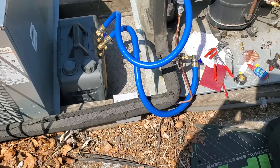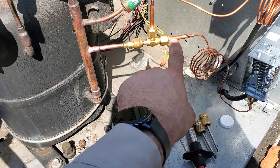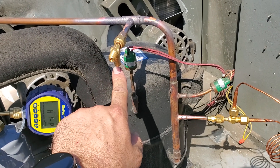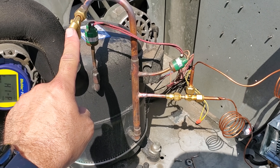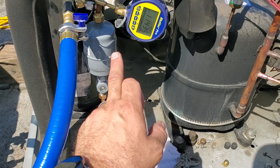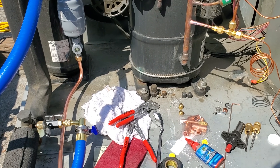We've got the vacuum pump running now, pulling through the system. The logic here: high side pressure port with a Schrader for both fan cycle controls. I also brazed in another T with an access fitting and put Schraders on both sides. This is so if we ever have a high pressure control failure, we can add another pressure control port without having to recover the charge. It also gives me a port to measure high pressure directly instead of just the liquid line port on the receiver. I also eliminated the redundant service valve since there's already a king valve there. We're at about 3,700 microns and dropping.